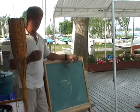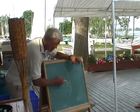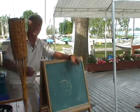As the breeze comes on, what happens is you start putting vang on, you start putting sheet on, you start putting all these things on. Now you can't control the mast bend. What happens now is the mast bends too much.